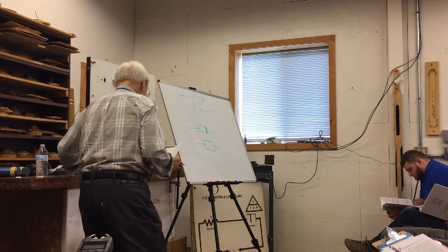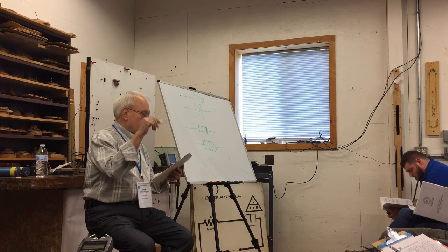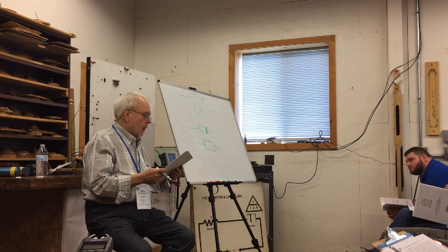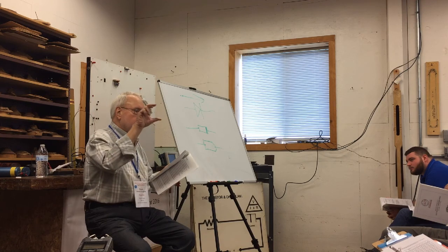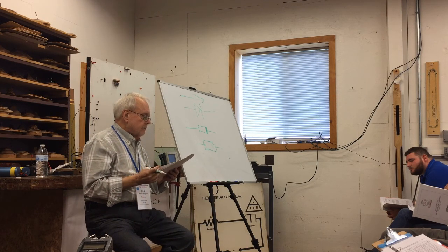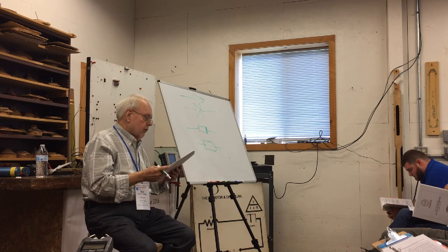Back in the good old days, we used generators to produce DC, both in organs and in cars. Coils wound on an armature spun around within a magnetic field. Each coil was connected to a pair of copper strips at one end of the armature shaft, called a commutator, and there would be a dozen or so separate coils, each wired independently to opposite pieces of copper in the commutator. Carbon brushes touched the commutator in such a way that only the one coil of the armature that was producing voltage of the correct polarity at any one moment would get connected to the output of the generator.